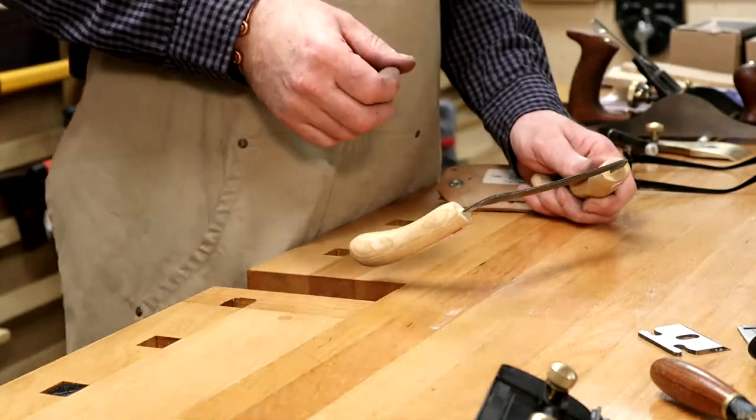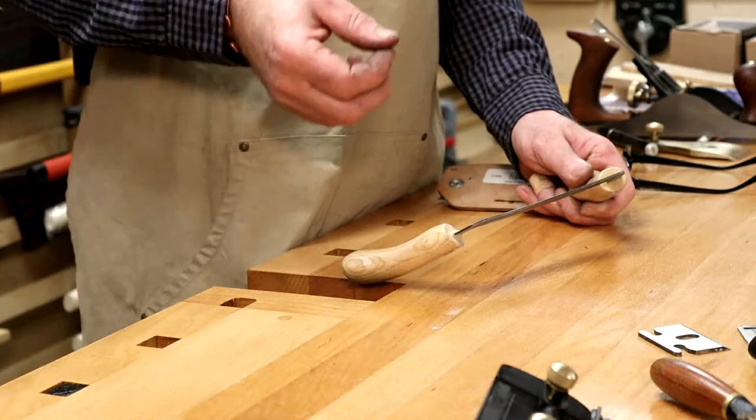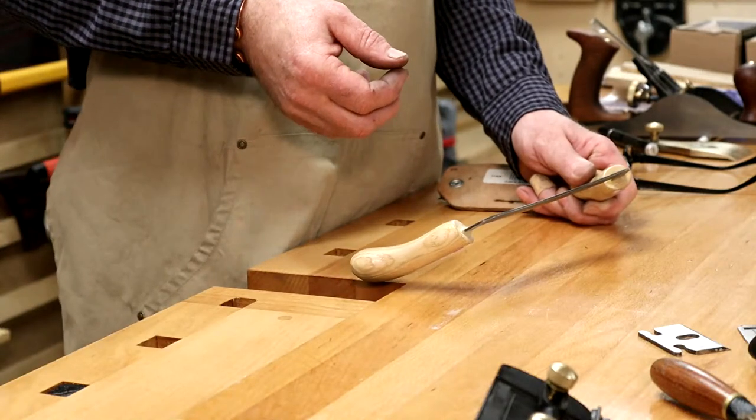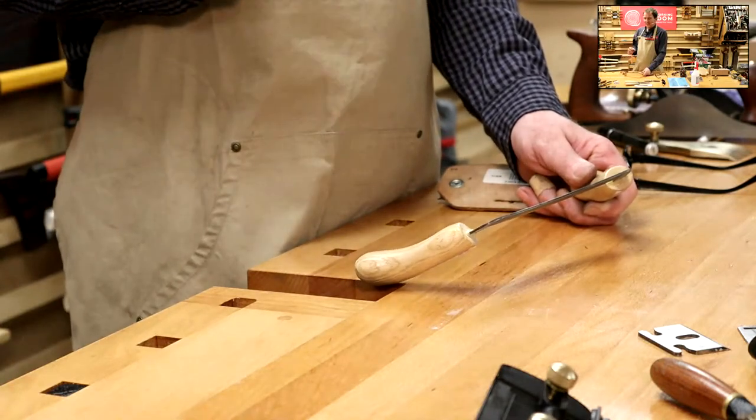If they're badly chipped or damaged, you need to find somewhere grinding it. Bench grinder is a bit aggressive. Linisher would be better. Most factories actually that are making tools use linisher, so a bit like we do our Ultimate Edge, exactly the same sort of thing.